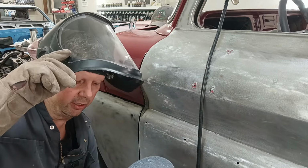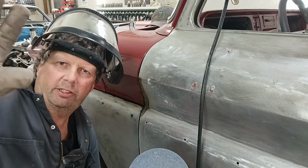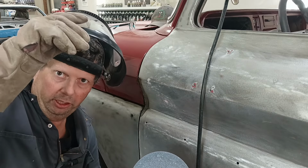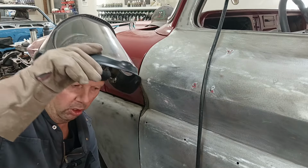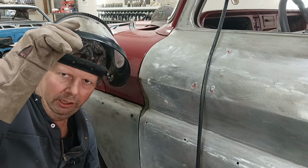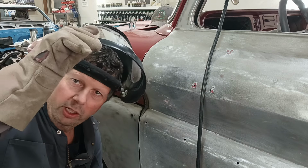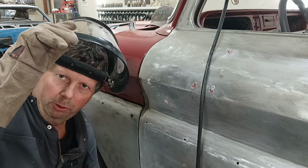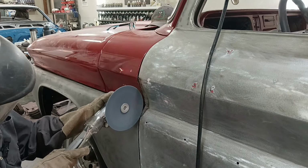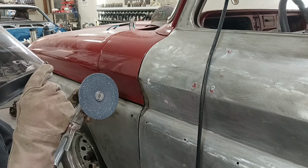When you're doing stuff like this, hang on to it. Don't be going all limp-wristed, hanging on to it. Guys who get into trouble with tools and with grinders and with drills are the ones who weren't manhandling them. You got to hang on to that thing like it's a chunk of morning wood. Grip it. Otherwise, when it grabs and snags, you're going to get into trouble. So just remember, white knuckle it. It's gonna happen.